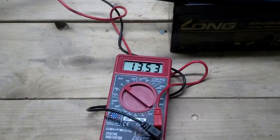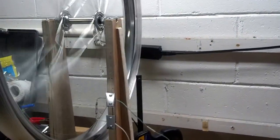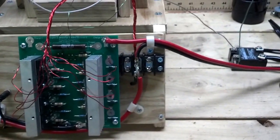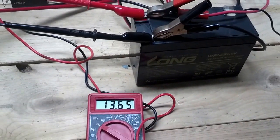So let me start up the machine. You can see the charge on the battery starts going up as the machine speeds up here. I don't know if you can hear this on the camera, but you can hear the reed ticking. So this capacitor is charging and discharging once per revolution on the wheel here. You can see the effect it has on the charge battery.